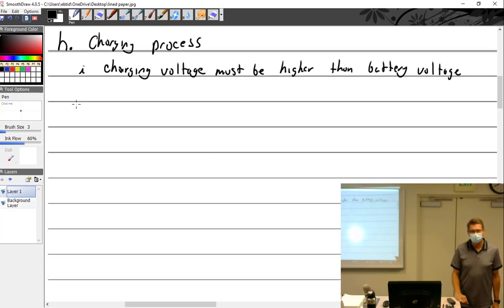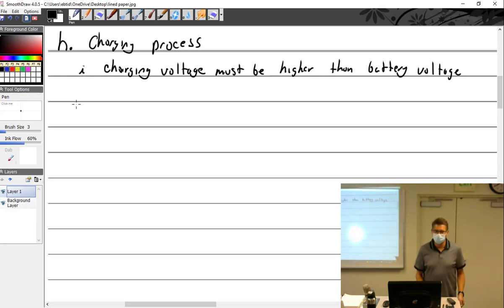What's happening? Battery's providing power. Generator's now offline. And so it's going to provide battery power all the way until you come in and land and finish your taxi and go around, do a touch and go, you hit the power and you're going to see that ammeter slam all the way over the other side to a positive 15. Why so high now? Charging. Got to charge the battery. Okay. So remember, battery can be a load or a help. It's one or the other.